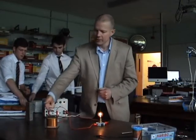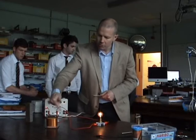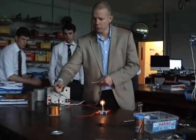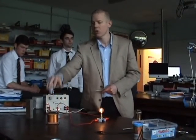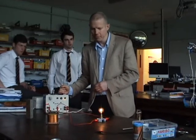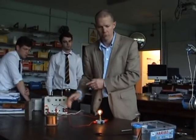The size of that back EMF is increased by just putting in an iron core. So there's two EMFs going on — a voltage coming from the supply and an opposing voltage being generated in the coil. The size of that opposing voltage is increased by putting the iron core into it, and also increased if you have more turns. If you reduce the number of turns, you've got less back EMF. Where is this being used outside the classroom? Dimmer switches. Industrial ones still have big clunky rods going into a core, whereas the ones at home are more electronic-based and work on a different principle.